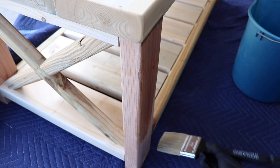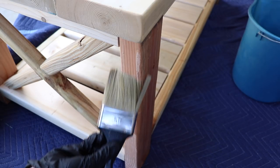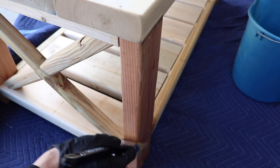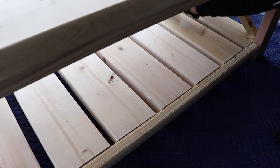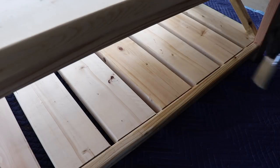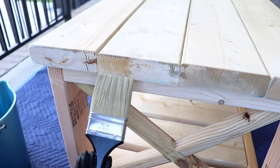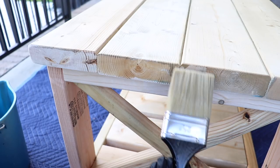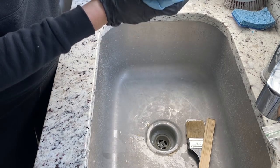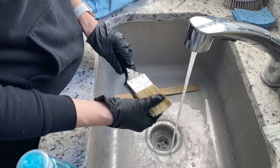With most wood species you're going to see this react right away — within five or ten minutes your wood's actually going to start changing color. But with pine it's a different story, and most of my table is made out of pine because that is typically what you're going to find in the common board section at Home Depot, and that's where we picked all our lumber from. So with pine you're going to need to set it out in the rain and the sunshine in order to mature the patina for a couple of weeks. Cleanup is super simple — I'm just saving the mixed-up solution. You can keep this for a minimum of five years as long as it's in an airtight container, so I just put it in a mason jar and cleaned up my brush and bucket with soap and water.